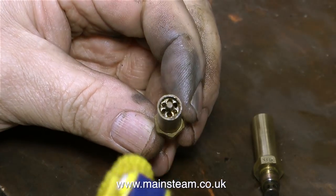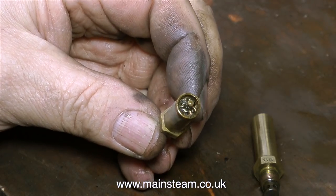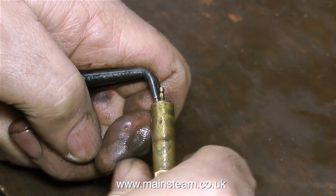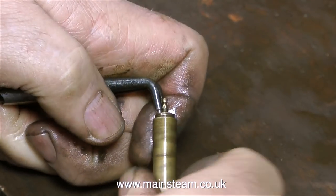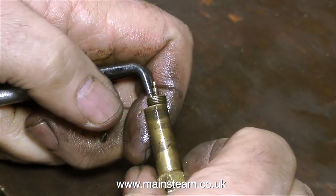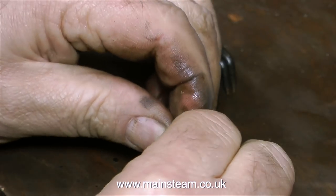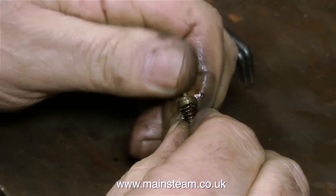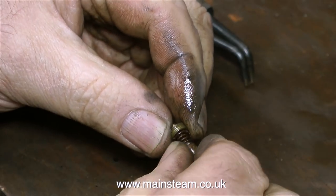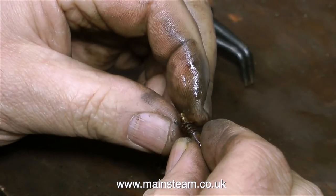So that's one down and one to go. This is the other safety valve, and this was very difficult to get apart because it was very rusty. Now that's odd — safety valves should not be rusty — but this one was, and that really made it difficult to remove the spring adjusting ring. But eventually, with a bit of WD-40 coupled with a bit of time and patience, I finally managed to remove the adjusting ring from the body of the safety valve. And look at the state of the spring — the other one was rusty, but not as bad as this one. This spring is mainly rust, so I'm going to put that in the bin and make another one.